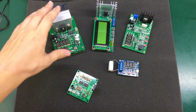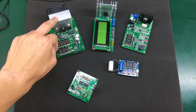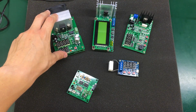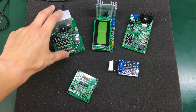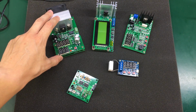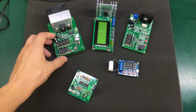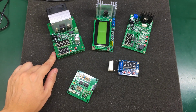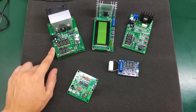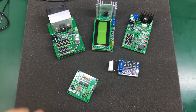Second best, the one that has nice features but also higher power capability, is the ZPB30A1, which can go up to 30 volts, 10 amps and up to 60 watts dissipated power. This one has temperature protection, which is nice, but lacks the serial interface for logging and doing graphs. As shown in my review video, it does have a serial pin header on the side of the board, but you don't get too much info, and you don't have any PC app to log that.